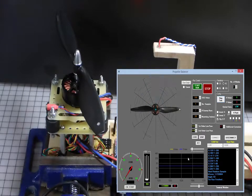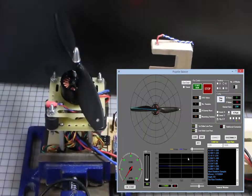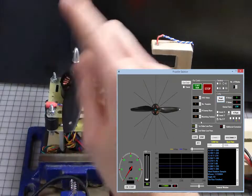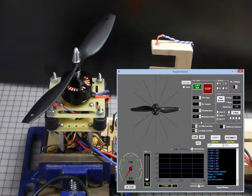Another thing that can aid you in orientation — in the test sensors area, if you take your rig and tilt it, notice that it's pointing in one direction, and then when you tilt it the other way it points to the other side. It helps you determine your X and Y, though it's really not meant for orientation — the proper way is really to go through the process I showed with a piece of tape to determine the imbalance of the prop. Similarly, for a counter-clockwise rotating prop, you have to go through the same process because the calibration will not be the same — the forces change when the prop rotates clockwise. It's going to take a little time and you have to be patient, but once you calibrate it it's going to be pretty spot on to help you calibrate your motor and prop combination. I hope this helped — let me know if you have any questions, and thanks for watching.